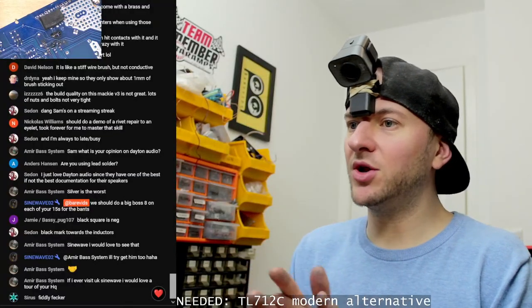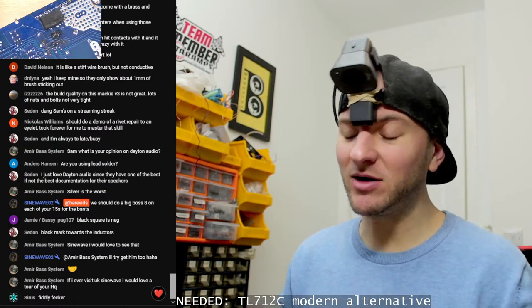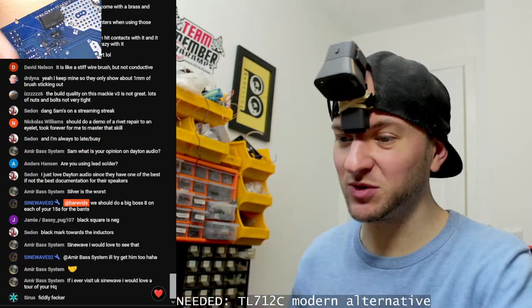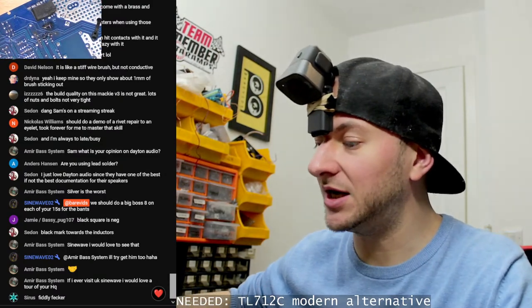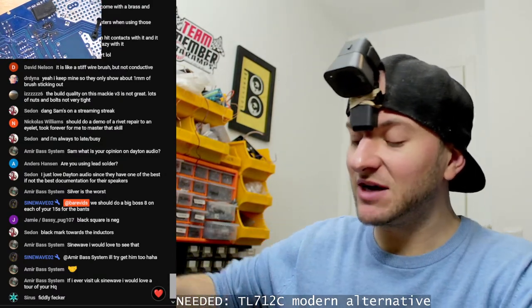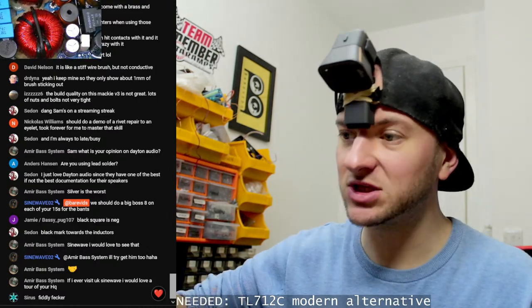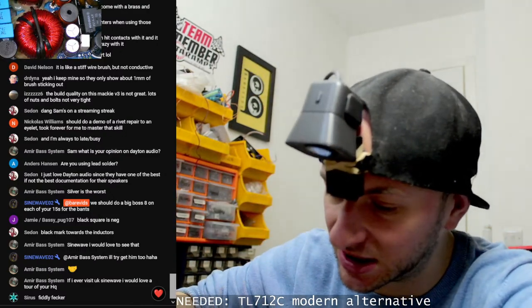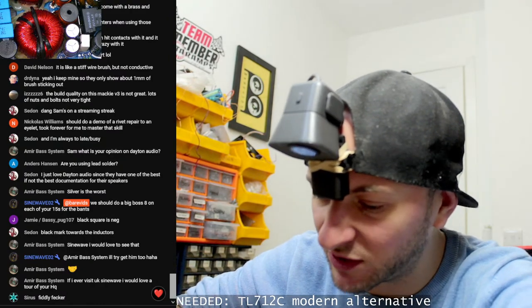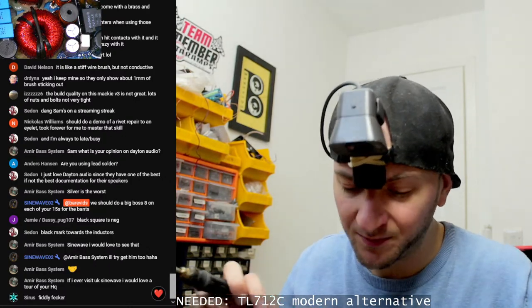So we should do Big Boss 8 on each of your 15s for the bants. Yeah, that would be pretty cool. Although the power supply system in the van is stock alternator, just with 4 AGMs. It's not that beefy. We could do that, but the limiting factor in my van for power, the thing that prevents me from running more power in the van, is actually woofer excursion. Sucks. The enclosure is not perfect for my DDZ4s. It's a bit too big perhaps, but there's not enough port area for sure. So I reach mechanical excursion limit before I reach the limits of my vehicle supply in the van.